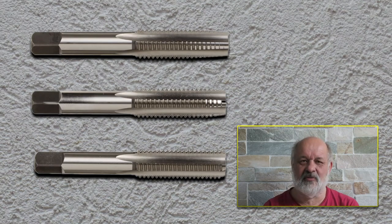The best option anyway is to use some sort of guidance. You can use a spring-loaded center, or put it on your drill press and use that. Or you can start in a lathe, and if you cannot do it all the way, you just take the piece off and then continue manually.